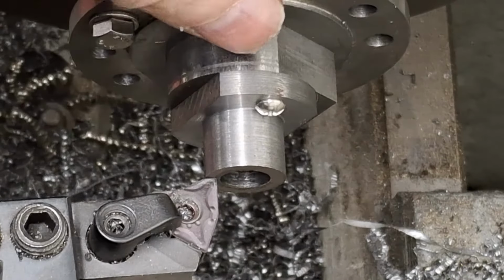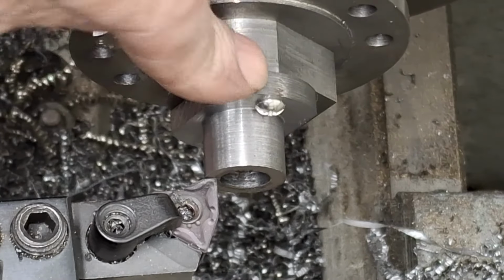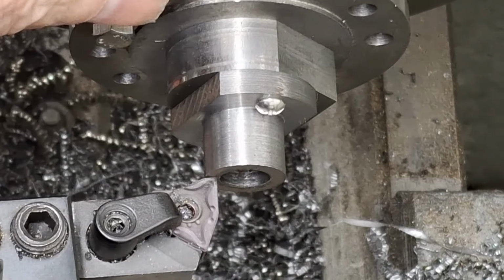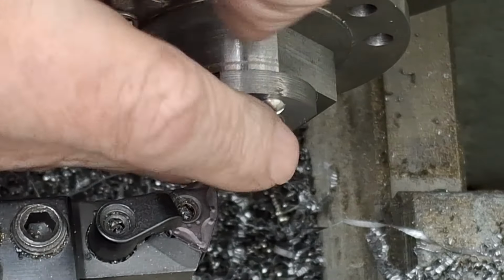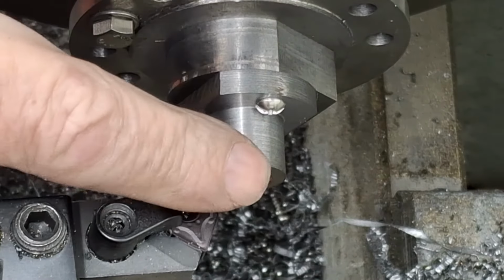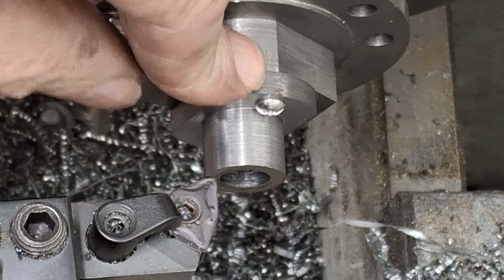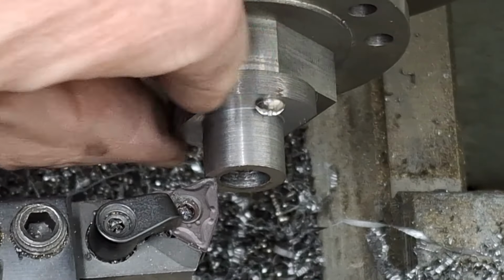Righto, guys, here we go. Just made those two little buttons. I'll show you those when we get to using them in the next operation. So, behind this cylinder cover, we've got the split ring, so it's holding on the register that will go into the cylinder bore. I've used 2 temporary little screws to hold the valve gland on, but of course it's the wrong way around, so we can get to this end. As I was tightening up, I had a piece of what will eventually be the piston rod going through the hole in both, so they're lined up as best we can.